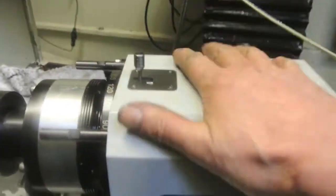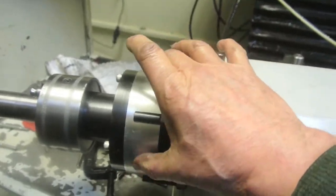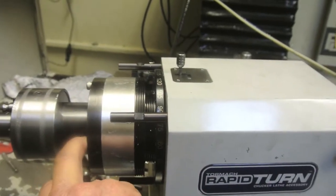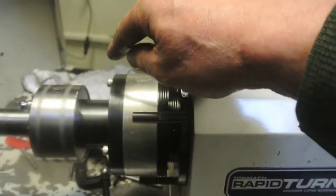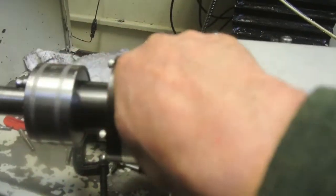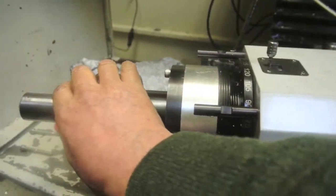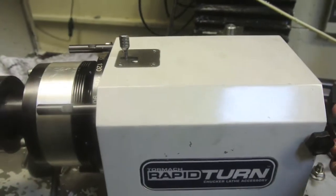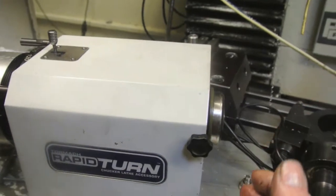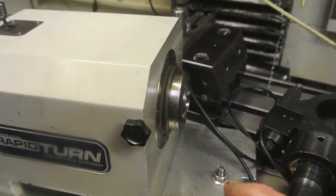First thing was I mounted the rapid turn on the lathe and machined a register on the back of this pulley. I then made my spacer so that this stood off the end of the spindle, clear of it, and I also made a register to suit this part of the collet closer. Then with a hand drill I locked the spindle and drilled through and tapped the holes with it in situ. I put it in the lathe, cut a little bit off to length — it still needs about an eighth of an inch off. The collet doesn't draw quite closed, so about an eighth to three-sixteenths max. I've allowed plenty of thread so it won't bottom out in the tube.